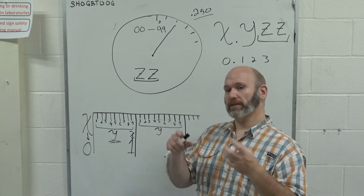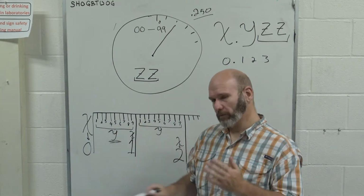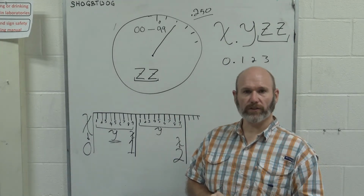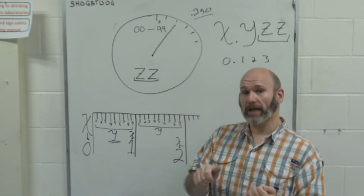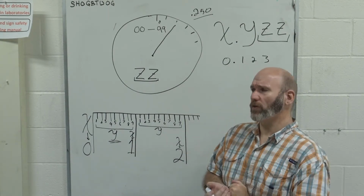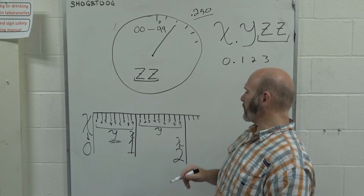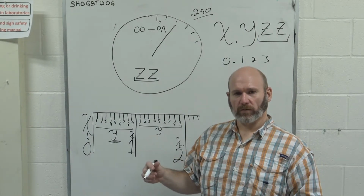You can open up things like bigger values that are closer to these numbers right up near the edge. And you can say, okay, I know that 15/16ths is this value, or whatever values you choose, and you can compare them to a scale and say, okay, am I right on the money? Am I way off? What's going on? Because what you'll notice is that if you are off, you will be off by a full 100 thousandths, which is easily noticeable if you're comparing that to a scale. So, there again, any questions that you may have, please come and ask one of us.